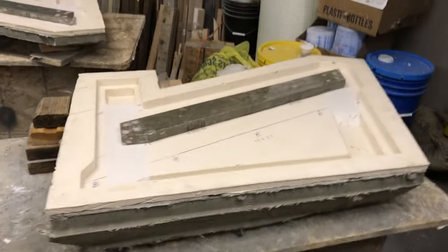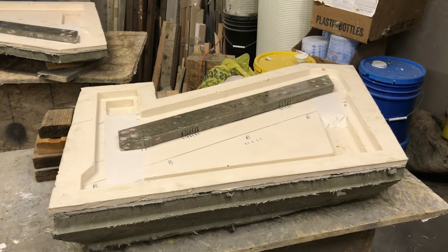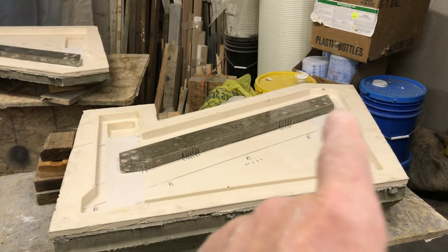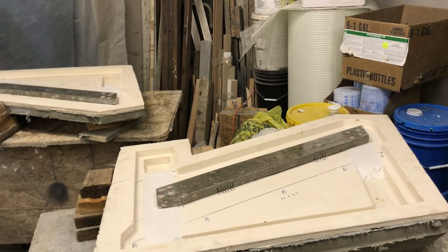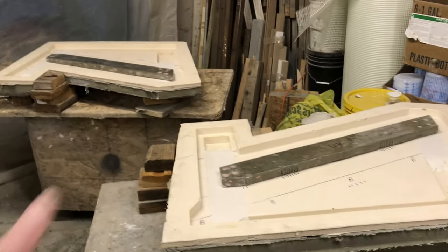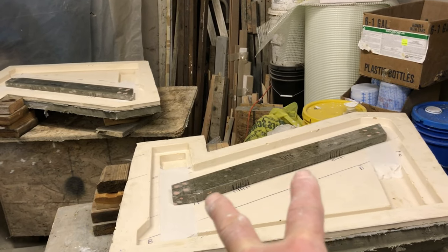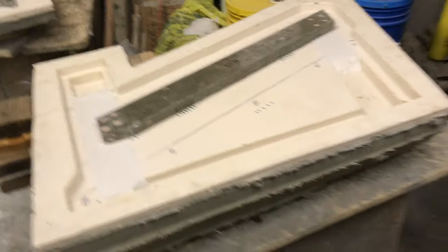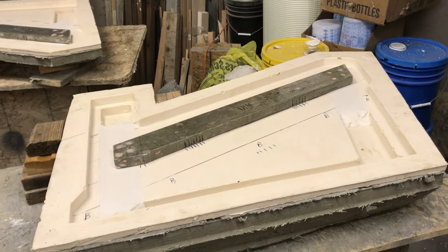I got all the plastering done to fill the lower areas on all the molds that needed it. We're looking at this stringer — we're making a rubber mold inside of a mold, a detachable insert, and you'll see that once we get to casting. These two molds have the stringers ready. There are holes that go through the plywood area — it'll now become just a rubber insert — but I've got to fix it so it doesn't move, because it's right where I want it.